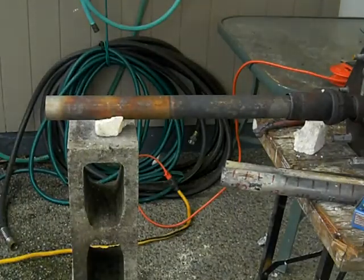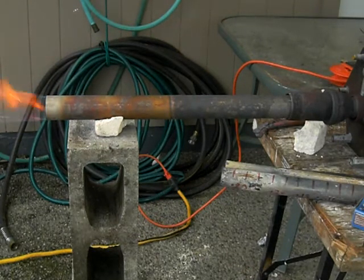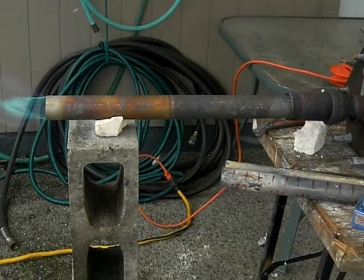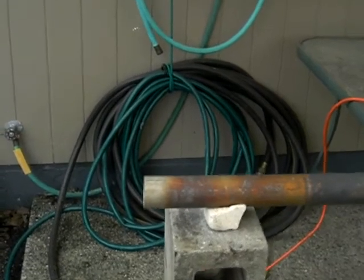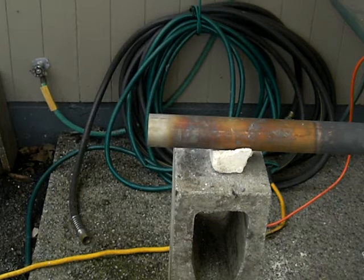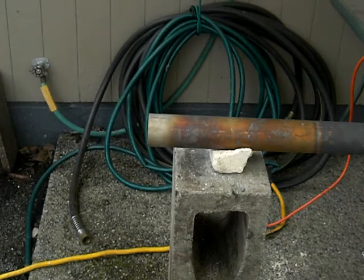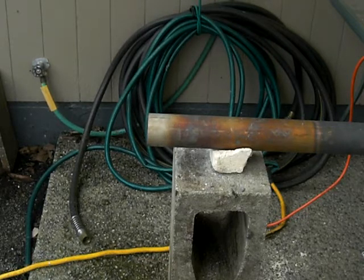Oh, hang on here. Better turn on the handle. Bring down the propane. Has to warm up here. There, good steady burn. We did not get this at the 24-inch mark, but we do get a steady burn at the 23-inch. I'm just going to turn the propane down just a bit more to kill the over flame. As you can see, turning on the propane caused it to go resonant.